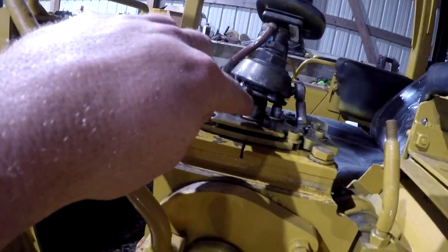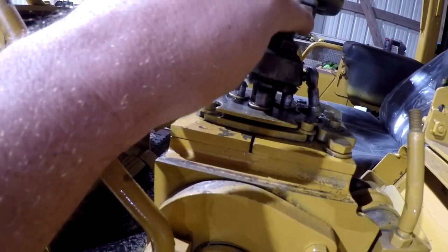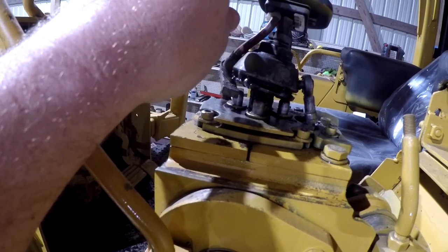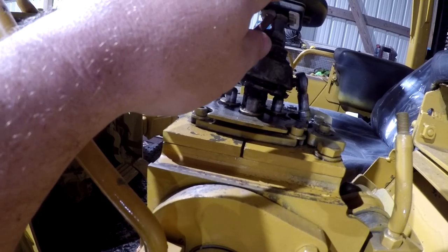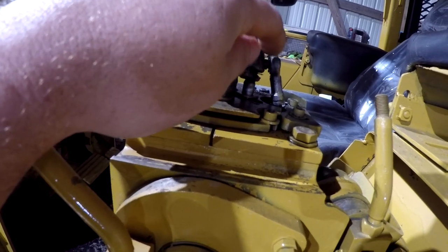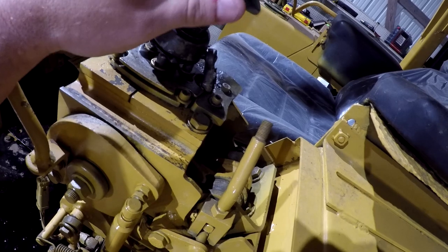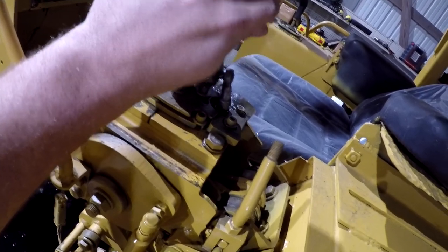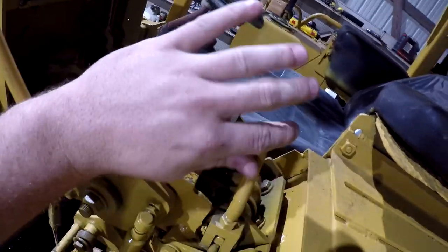What I got is the plungers up here. They're leaking. I got those in, and then the swivel right here is bad. Now, they make a couple different swivels for this, I believe, because this joystick was used on dozers and excavators. And on like 2 year models of these dozers, the later year models, it had this little heim joint deal here that goes to this locking device here. This is so that the joystick can be locked in a position, forward or reverse or whatever.